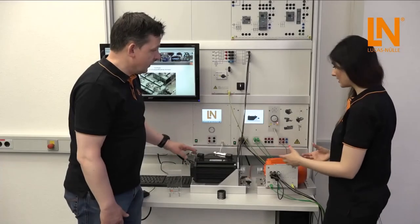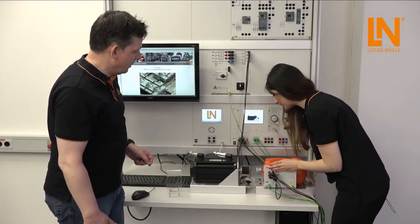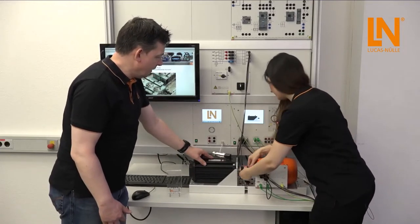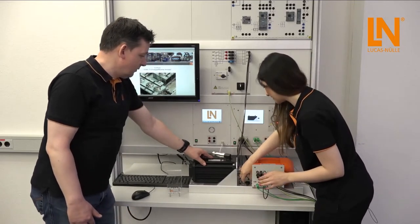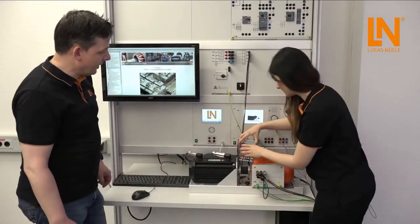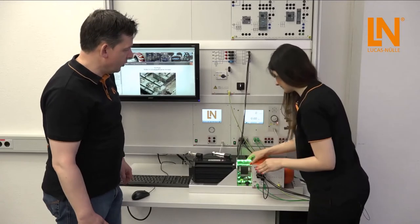Should we try to set it up together? Yeah, just try it here — take the coupler. I have to make sure that the coupler is positioned correctly, and then you can move it together. You need to be careful when it fits and then you can bring it together and fix the screw. Then use the shaft cover — take the shaft cover correctly and bring it into position.